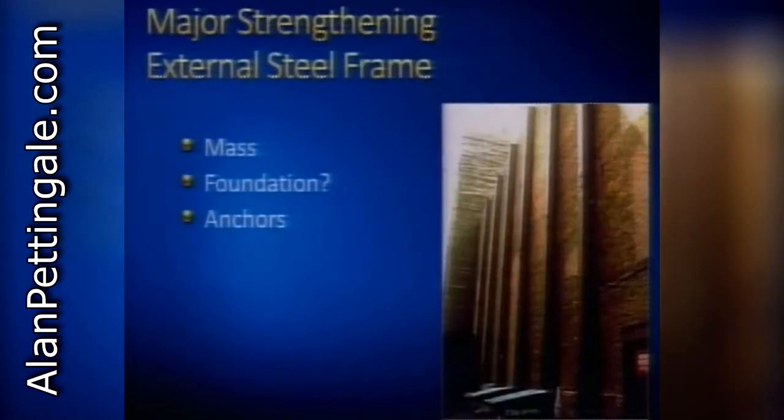There are more elegant approaches. In lieu of a reinforced concrete overlay, you can install external steel frame systems. They don't add a lot of mass to the wall system, though they do change the appearance. Here you see a series of steel tubes as strongbacks, stiffening the wall to take lateral loads. It's a good approach from the standpoint that if you have a better idea or better budget in the future, you can remove these external steel braces without much problem.